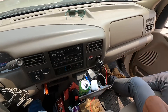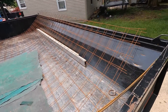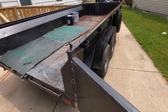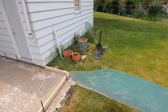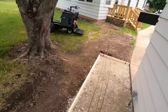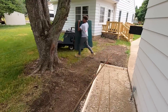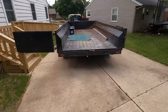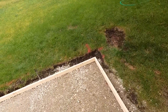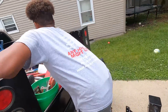But first I gotta jump over Lake Michigan here. All right, we just got here to the job. We're gonna unload all this stuff. Set all the stamps up over here, Jaron, and make sure to keep the face — the stamp portion — up. We're gonna have two pieces of rebar in here, then we're gonna cut this individual one up to make it into some dowels, and the wire mesh goes in the bigger spot. It rained all day yesterday but all the water drained out of this pretty good.